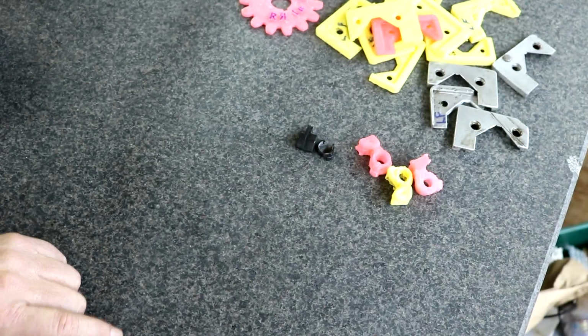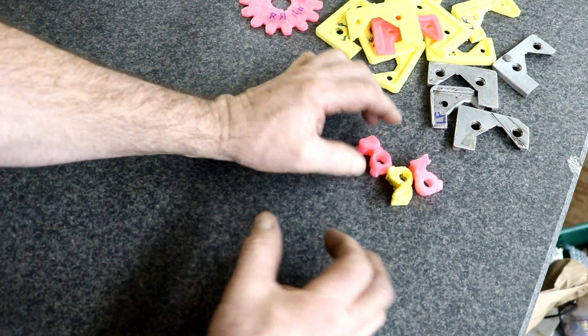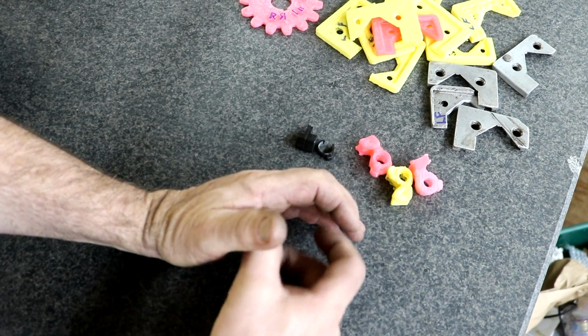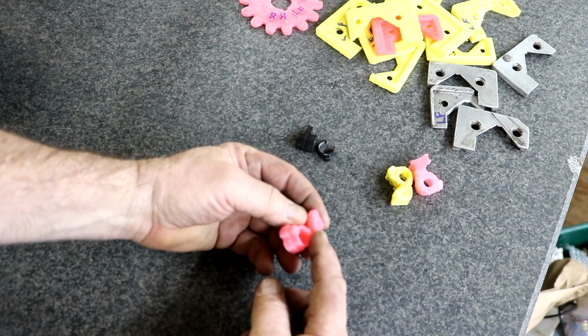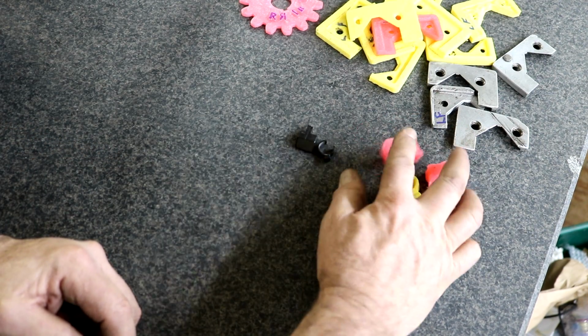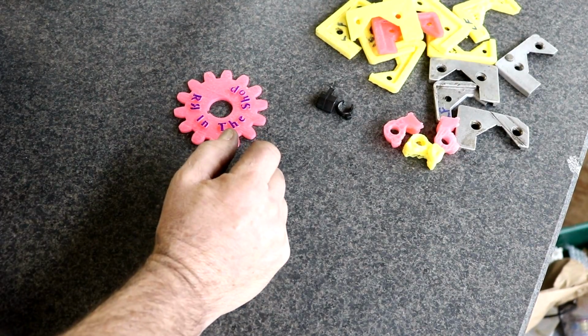I did one other one, little hand wheels for the little flat. They're just flat. I tried to do a boss on a little gear type hand wheel for the printer. They're on the bed adjusters, and having a boss on it, it melted in the same fashion as this, or flowed over. So small areas are difficult. Anyway, we'll be continuing on and figuring some more stuff out on the printer.